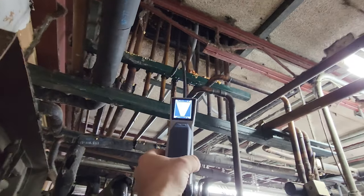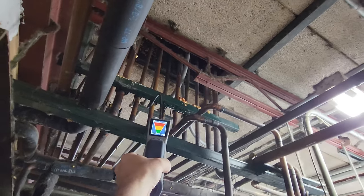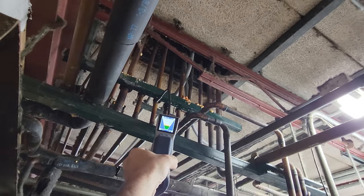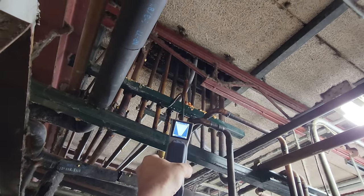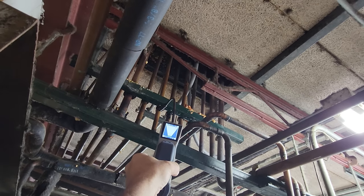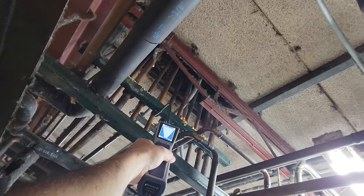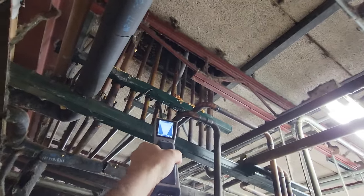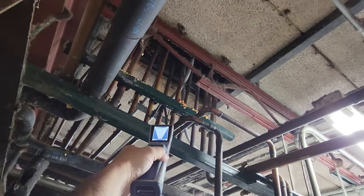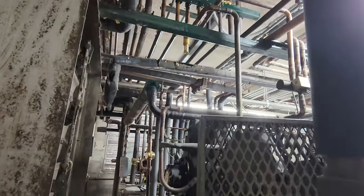Now you can't do this with an H10 because you can't reach it with an H10. Now that it's been off for a little bit, the pressure is starting to build up. So yeah, we got it right there — either that one or the one beside. Yeah, it's that one there I think. Obviously it's leaked bad enough. You can see that pipe right there — it wiggles. That's what's happened. Whoever did it didn't tighten the clamp up and it vibrated into it. I'll guarantee it.